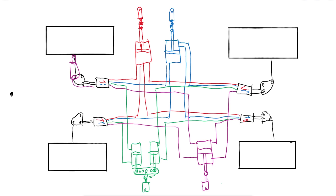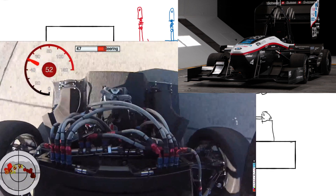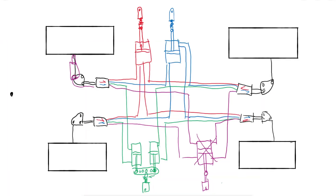This system would appear on more cars if not for the prohibitive expense of custom cylinders. I'm not the first to conceive of this — a number of Formula Student teams run it very effectively. A great example is AMZ Racing from ETH Zurich, who have a really cool setup where they handle warp with a damper built directly into their roll unit and lever system rather than a separate warp piston. I'll put links in the description so you can see how their system works in practice — it's super cool and well worth checking out. That is overall how you achieve a fully mode-decoupled suspension system.